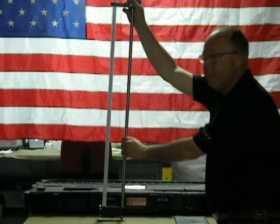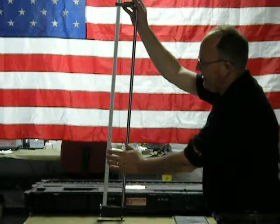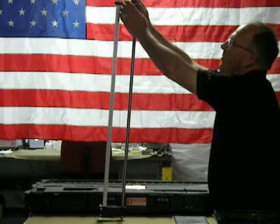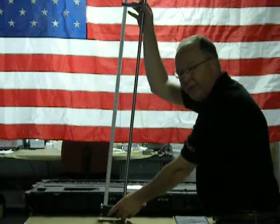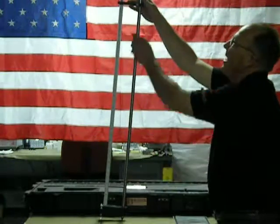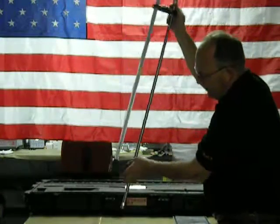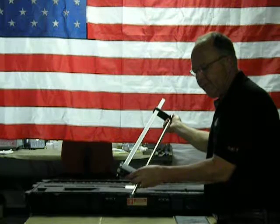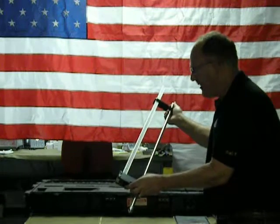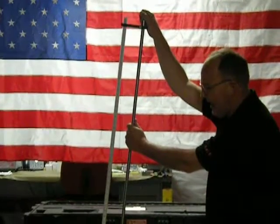The first major piece is the lower assembly, comprising the vertical scale with tenths of inches and millimeters, the upper attachment, and the lower attachment or foot that holds the vertical scale in place. The drive rod has two-inch increment rings for measuring without the vertical scale. At the end of the drive rod, we have the hardened reusable point for testing — you can perform up to 250 tests with a hardened point before it needs replacement. The cap at the top of the drive rod acts as the adapter for the quick disconnect.